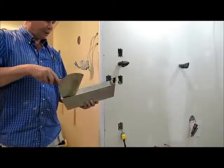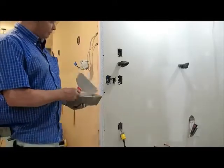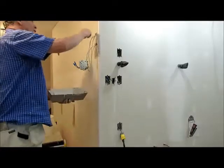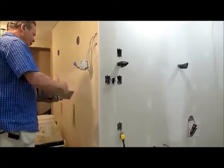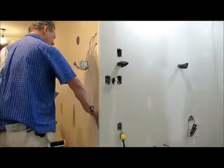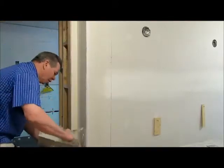What I call it is pre-bed or pre-bonding, and we use Durabond 90 — it's got a high density. You don't use pre-mix filler on a corner bead because some areas can get quite thick. I like to use an 8- or 10-inch wide knife. This seam has already been bonded and double coated, and there's our corner — bonded. Tomorrow we'll give it a little scrape down and rub it with a sanding block.